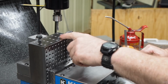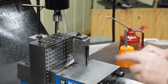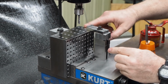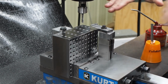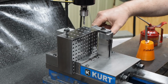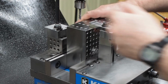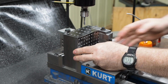We're going to get ready to tap the top, and so in the short term I just used some gauge blocks underneath here to hold this. This little lip is about 2/1000ths above this block. What happens with an automatic tap head is that when you reverse it, it could lift up the block, and you don't want to do that. I also had to modify and make a little spacer block and add another tap hole in the vise, so that I can come high enough for our handle there. Just some quick adjustments I had to make.